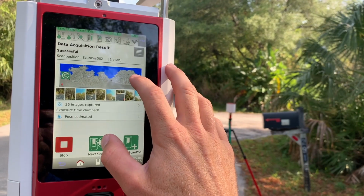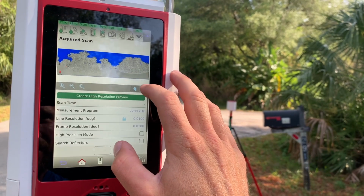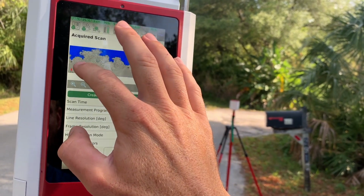The VZ does create a fantastic data set and also has some advantages on the processing side of things, which we'll look at in episode 4, but it's buggy, at least in my experience. This particular data set wasn't too bad in the field, although I had 2 scans fail randomly and the field registration quit for no apparent reason halfway through scanning. Luckily, I've seen both of those issues before and knew what to keep an eye out for and how to fix them. And since I'm still getting to know the VZ, I can only assume that I will get to know its quirks and in time it will be less of an issue.